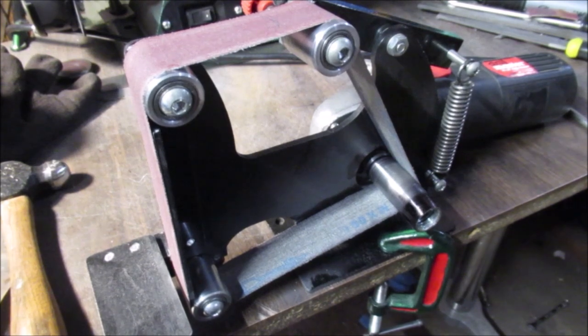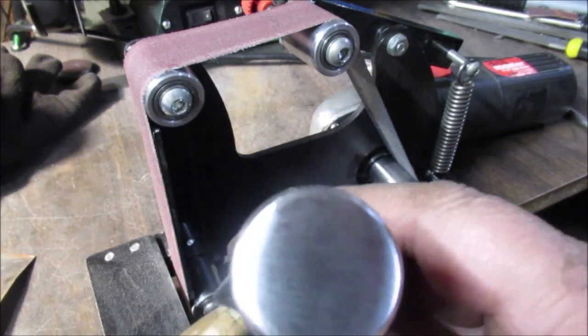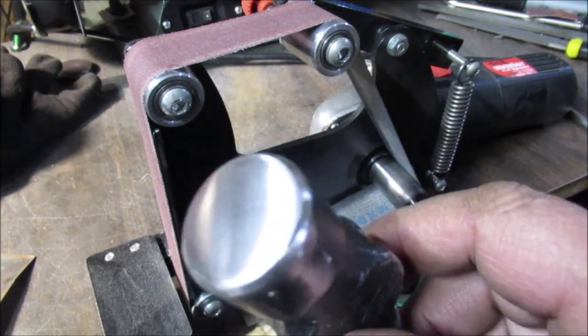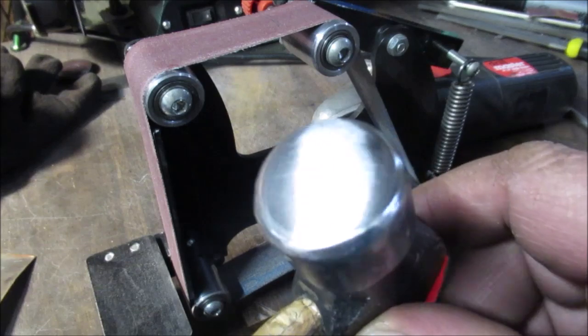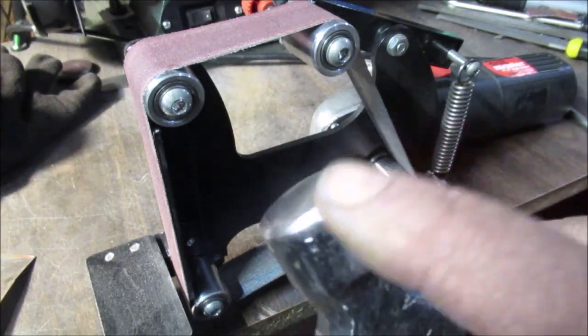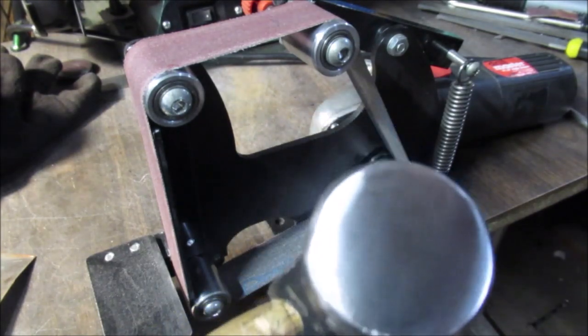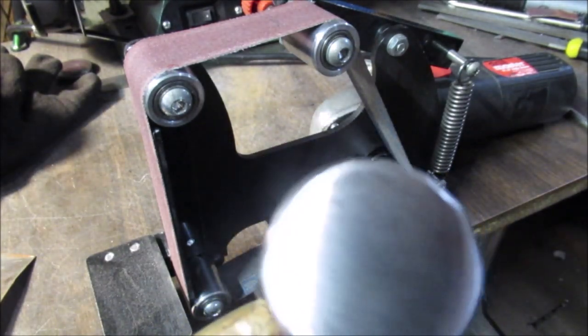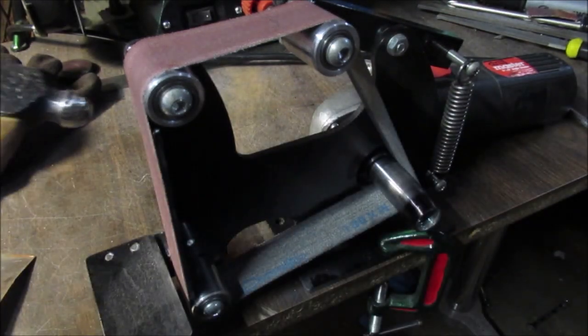Hello YouTube, we're using this to polish a hammerhead. I don't know the grit of it but it looks pretty good. I filed it — it was off a little bit, kind of chamfered it — then took it to my abrasive wheels, just my red coarse one, and then took it to this sandpaper.